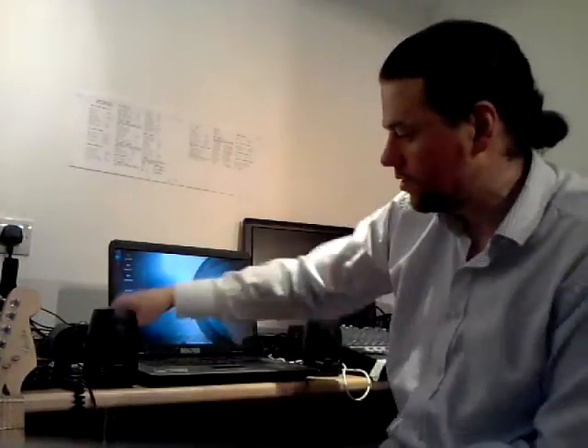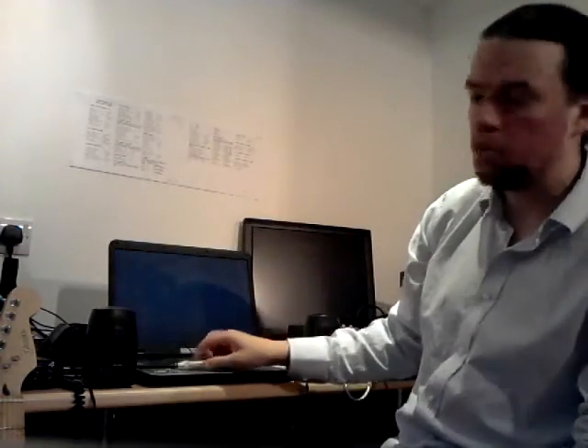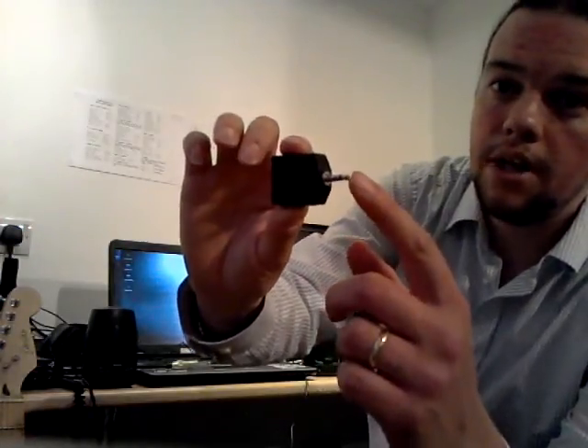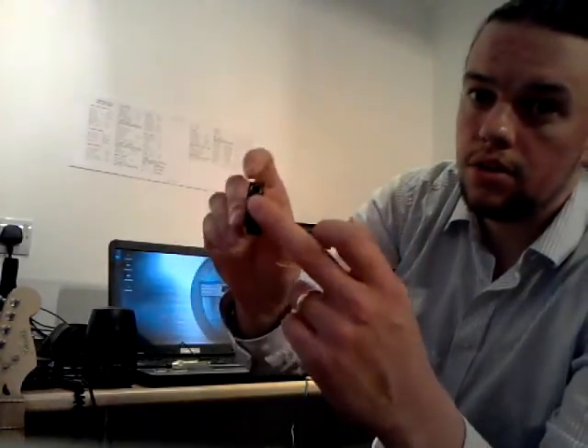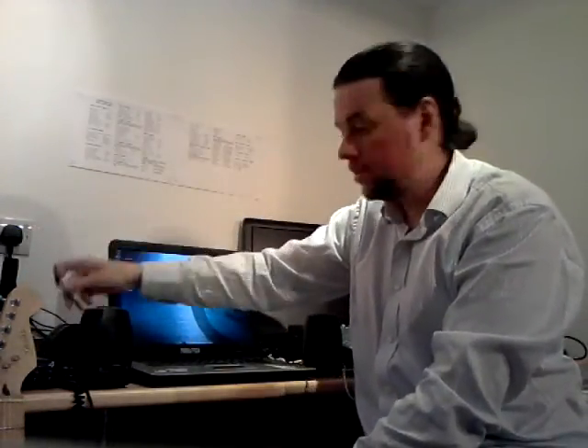For the input I'm going to be using a guitar — it's just something to make noise with. I unfortunately don't have a good way to get the guitar plugged into the laptop, so I'm using a stereo mini jack to two stereo quarter-inch jack converter. I'm going to plug the guitar into one of the stereo quarter-inch jack sockets, going into the microphone socket. Now what's important to realise is that although it's a stereo mini jack, it's going to show up as a mono input because the lead connecting the guitar to the converter is a mono lead.